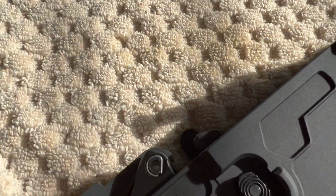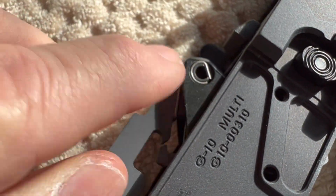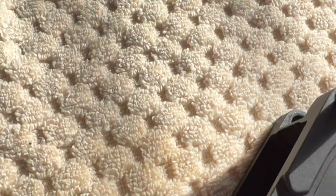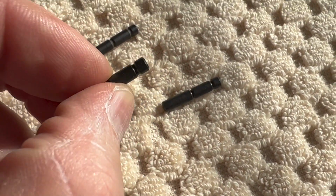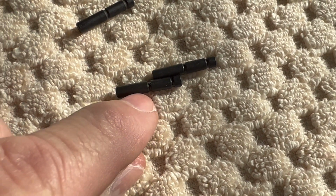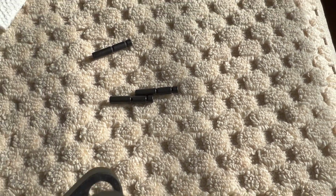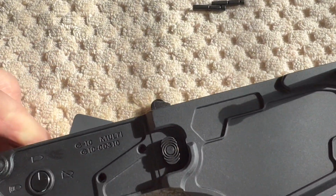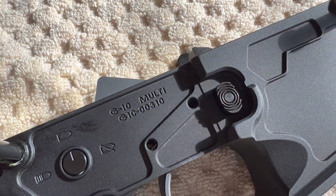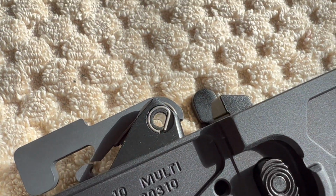But like I was saying earlier in the clip, because Wilson puts their capture spring on the right side, that means this groove has to locate into that. So now these become directional. And so we're going to put it in from the left side of the receiver and shove the pin into the right side and engage the little spring detent.